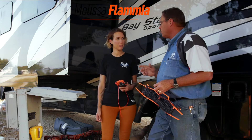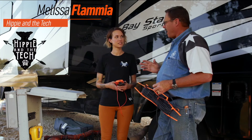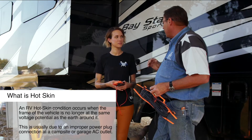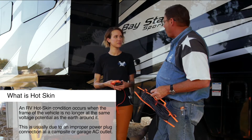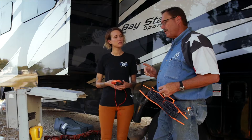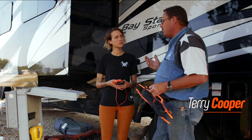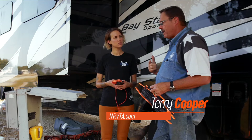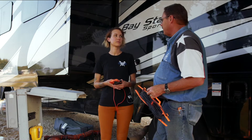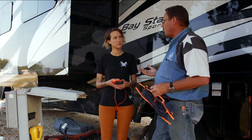Okay, what we're going to do is look for hot skin. Everybody says, 'hot skin, what is that?' That is something that's happened to this RV. Even though it has fiberglass walls, there are still certain places that have metal. So if somebody in the construction of this unit ran a screw or a staple and penetrated 120-volt wiring, now we've got something that's electrified.